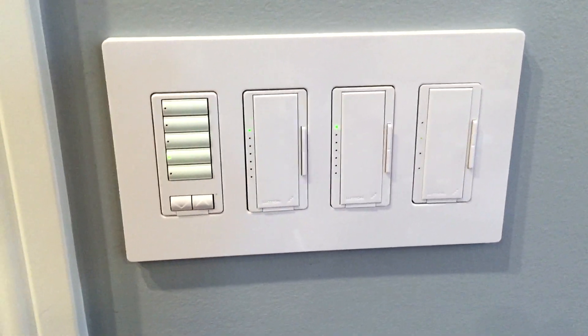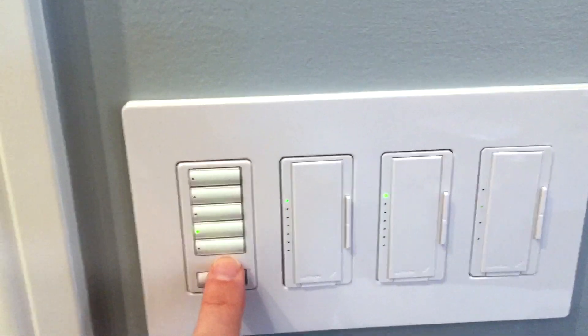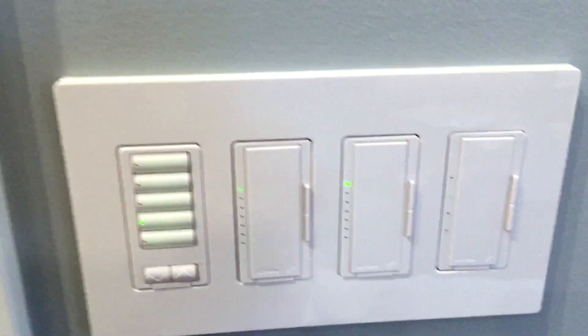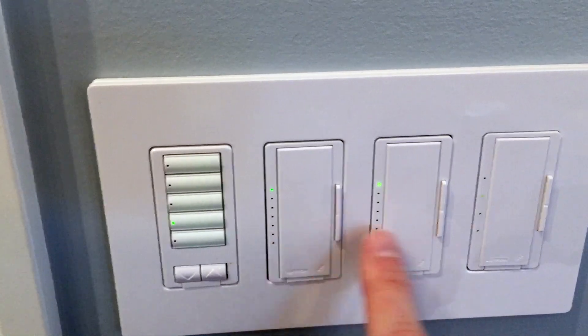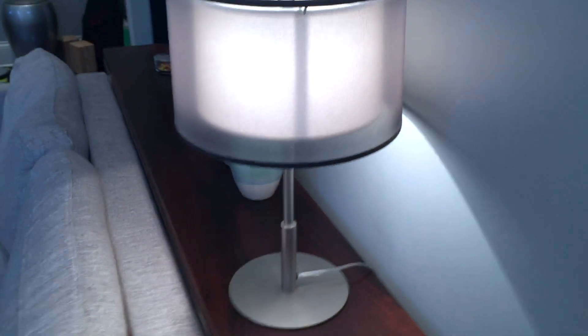With this particular wall station, we're controlling the lights in a living room with multiple zones. The first controller is a hybrid controller, giving a keypad to trigger the Lutron Radio RA2 system. We also have a fan controller and Radio RA2 dimmers. Individual floor and table lamps can be incorporated — this lamp is plugged into an accessory that integrates with the whole-house Radio RA2 system.